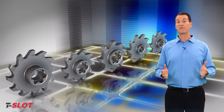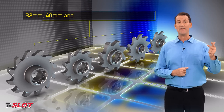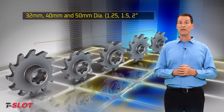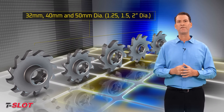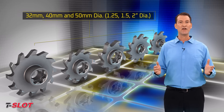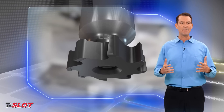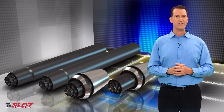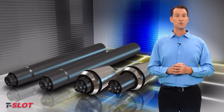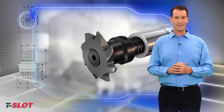Several unique features of the system include a wide range of 32, 40, and 50 mm diameter solid carbide milling heads with 8, 10, and 12 effective teeth and a width range of 1 to 12 mm. The solid heads are clamped onto the shanks with a central screw, and are available for steel and solid carbide shanks with different lengths. An SD adapter is also available for connecting SD T-slot heads with multi-master shanks.